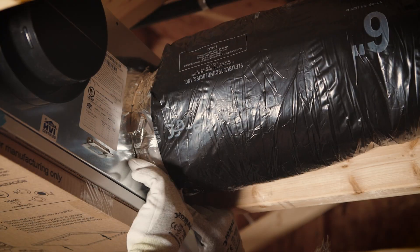Fasten them in place using duct tape. With the unit fully secured, electrical connections made, and ductwork fully sealed, locate and cut a 21 by 27 and a half inch hole in the ceiling or wall material.